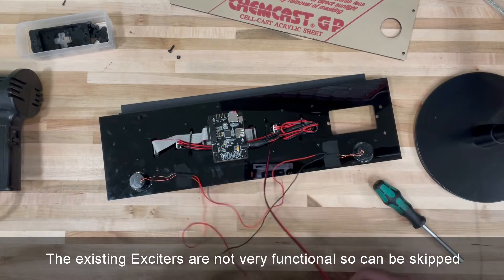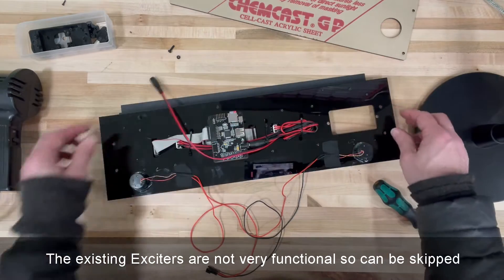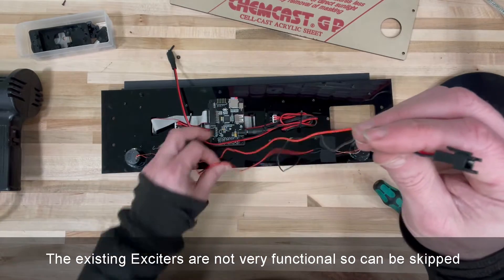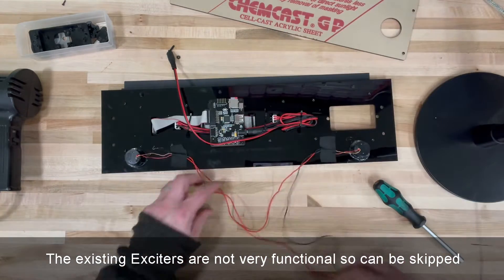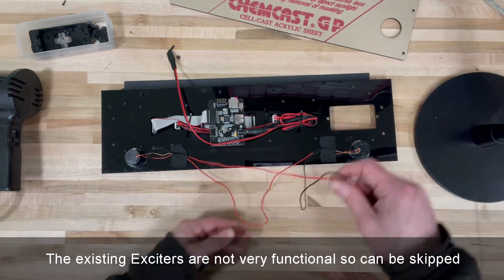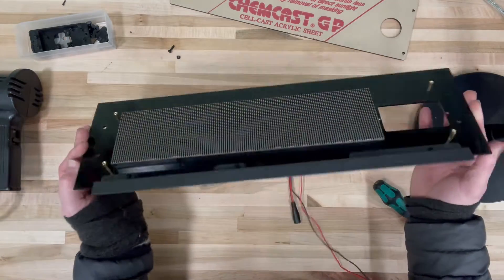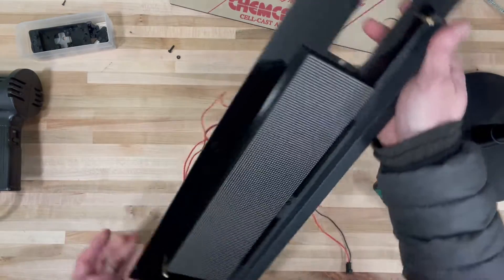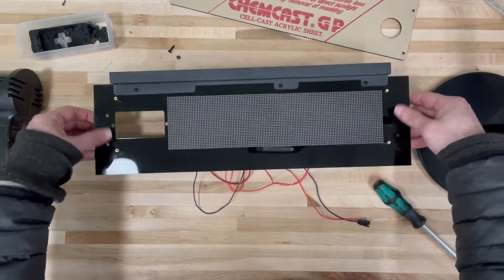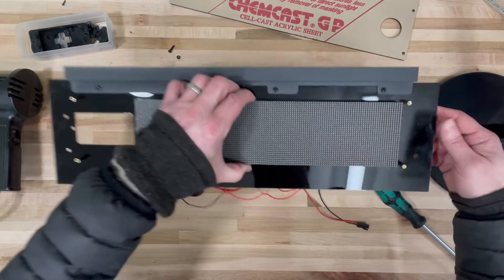We're done with this piece. This is the power cable for the DMD — that goes with a 5-volt, 10-amp power supply. And this is the cable for our exciters. We'll clean that up later, maybe do a little tie wrap. This is what it looks like from the bottom and the top. This is just going to slide like so, and then you see these screws here — those will line up with the existing screws on your AtGames pinball so you don't have to re-drill any holes.